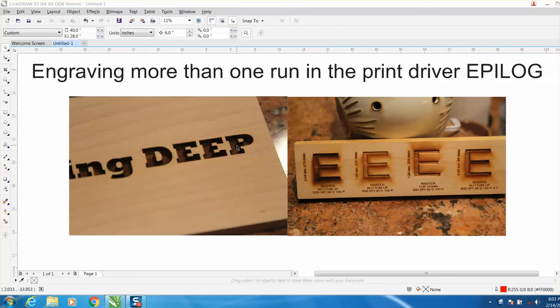In this diagram you can see most engravers' maximum is going to be 600 dots per inch. I ran this at 1200 DPI and it's pretty charred, versus this one over here which is 600 DPI — the exact same power and speed — but I ran it twice, and I'm almost to the same depth: one is 0.65 and the other is 0.675.